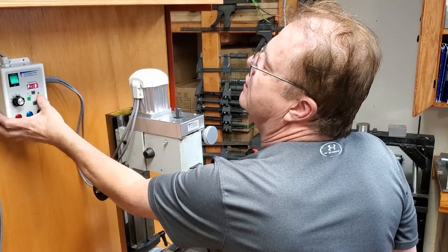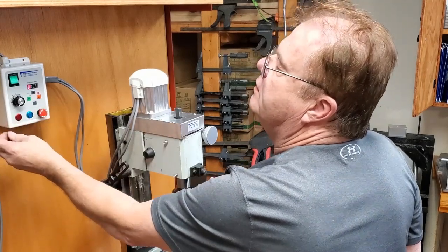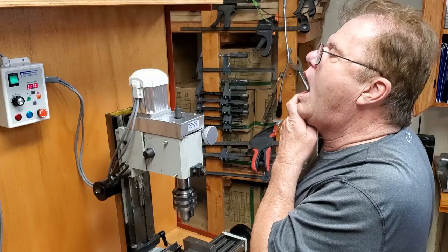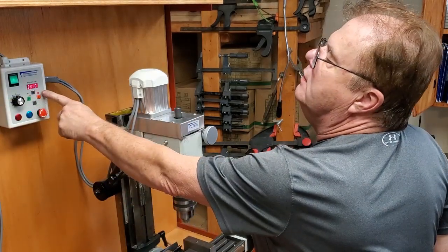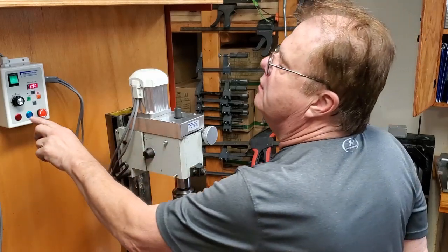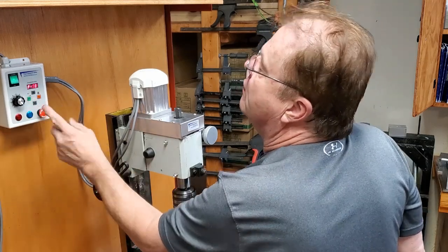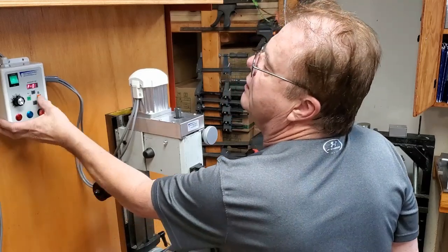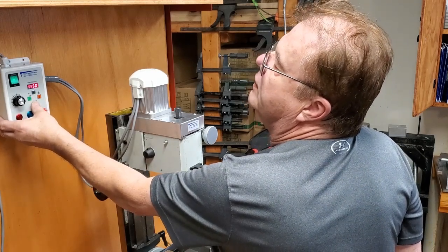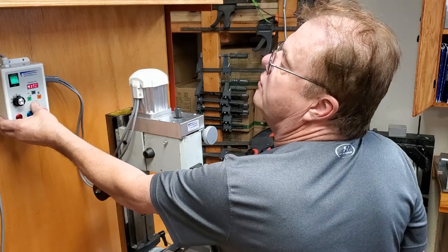Brake is parameter eight, it's on zero — that's where we'll leave it because it has reverse on the fly. Turn it on. Notice it's only reaching about 3900 RPM, but the maximum stop speed is set at 4500. We've exceeded what this particular motor wants to run, so we're going to go to parameter two which is top speed and drop the top speed down. It was running 3900, so we'll drop it to 4000.